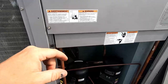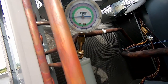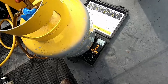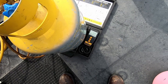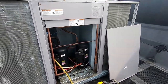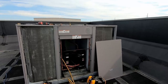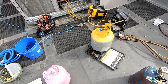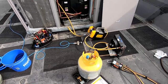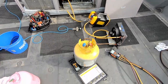If you go back and watch my other video, I followed their little chart, which I don't like. We've still got about 45 pounds of pressure on it and we've got 44 pounds 10 ounces - so we're a little overcharged. Going by their chart isn't very accurate. They always say to go by the nameplate, that's the most accurate because they've done all the testing and engineering. But this shows that chart is not adequate. When I showed low I had 14 degrees of sub-cooling and I still didn't hit what they wanted - I would have added even more and overcharged the unit.